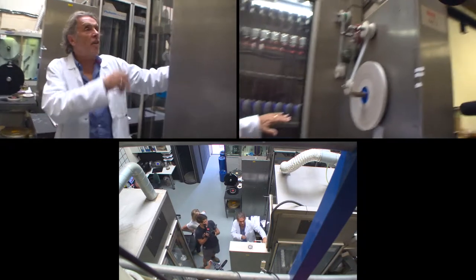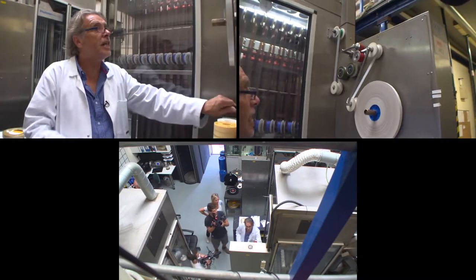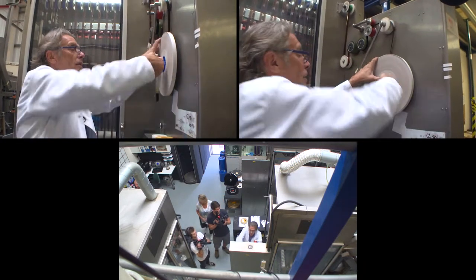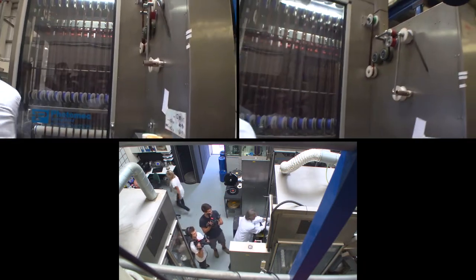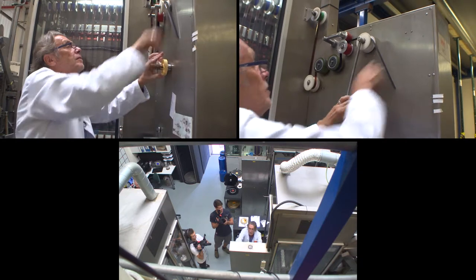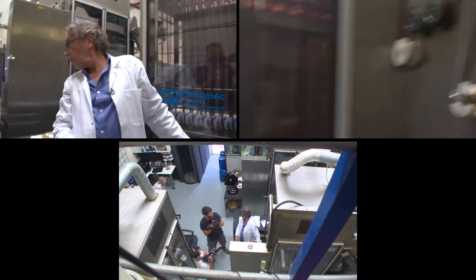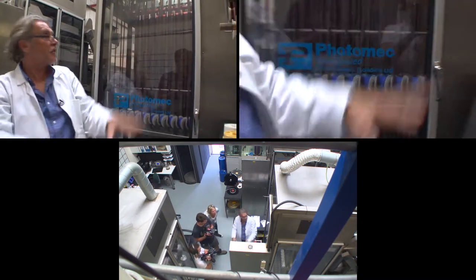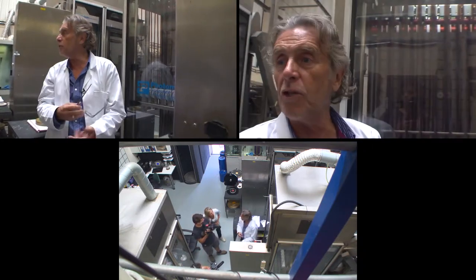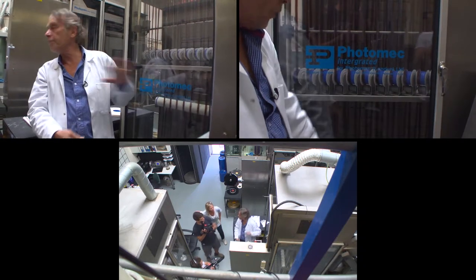This is a mirror image of the other end — where at the other end the elevator rises to feed the machine, this elevator will descend to absorb the film that's coming through. We have a specific amount of time to make the change here, to take this camera roll off while that elevator is falling. The elevator cannot hit the bottom — if you get to the bottom you've got a major problem, the machine will stop. The machine never stops and starts while there's film on it, and it's these elevators that work to allow that to happen at both ends.